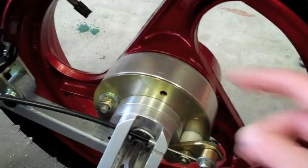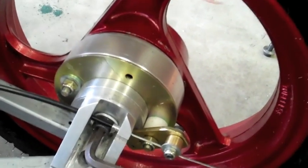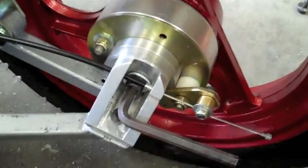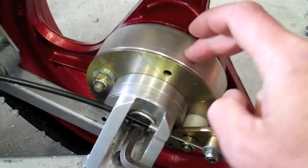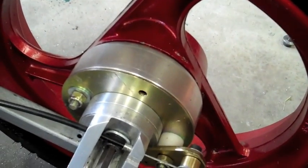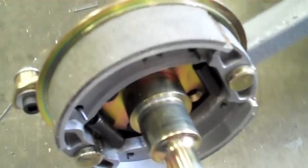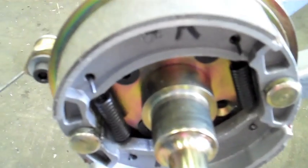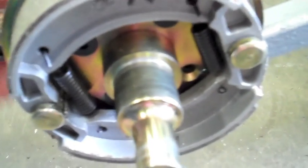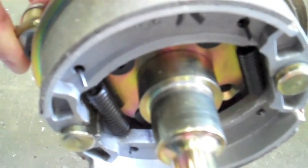The drums are fabricated from some centrifuge buckets that we found in a skip, and they just happen to be the perfect size for the job using moped brake shoes. As you can see, the internal of the brake hub is a very traditional drum brake — two moped shoes and a simple cam which forces them apart.